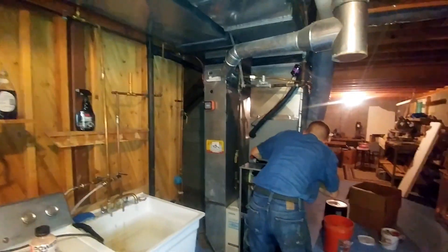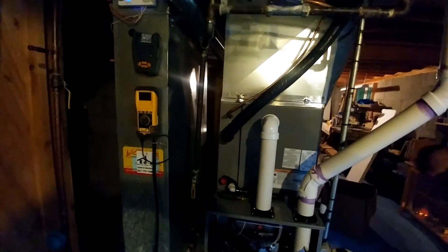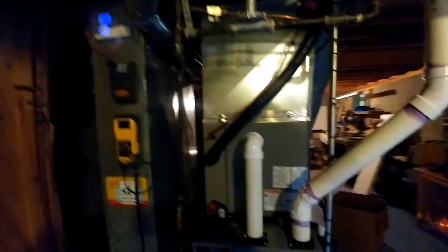Humidifier's done over here. No drain on the humidifier — did you bring some half inch in? We got our water hammer there. Water's hooked up, not leaking anymore. Reused a saddle valve that was sitting there. My battery's getting low so I got no light. CO's down to zero on this guy. Humidifier — she's working.